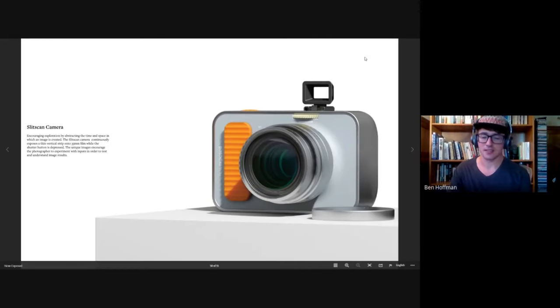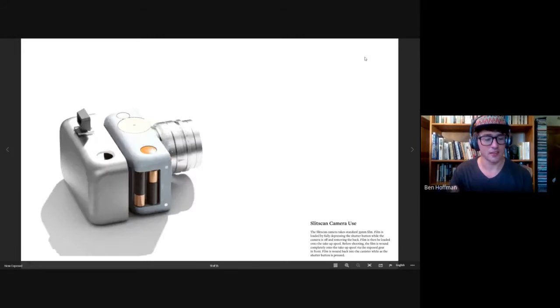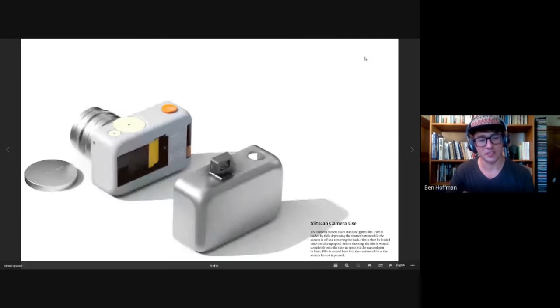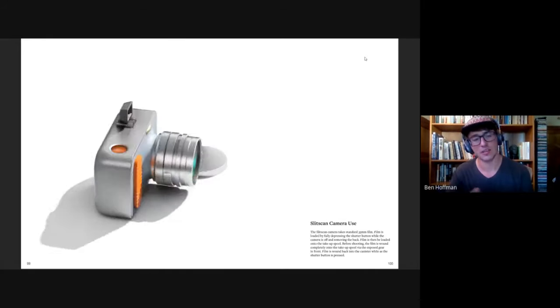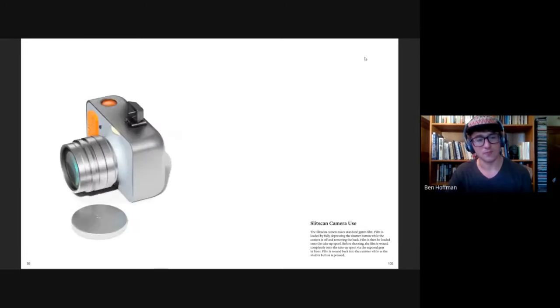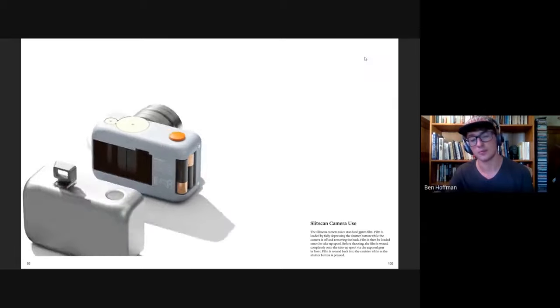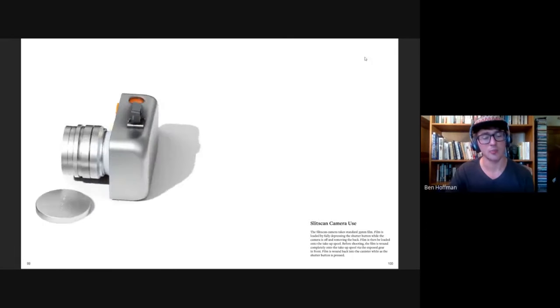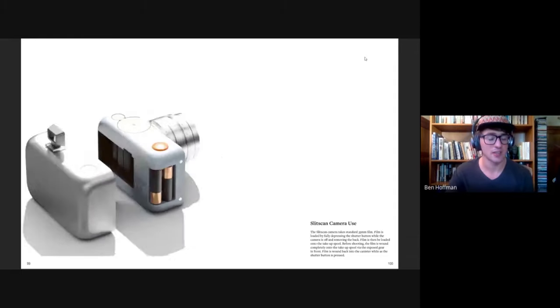And then I guess the final camera being the slit scan. Again, kind of keeping with the form language. In this case, for loading it, we figured that it would be easier to wind back into the film canister and then approximate for the increasing radius of the film. Because if you want a static exposure across all of this, and the same thing with frame spacing, you run into the problem of the thing you're winding onto constantly changing in radius.